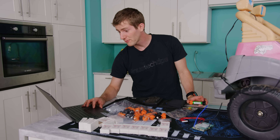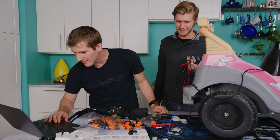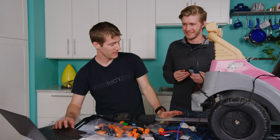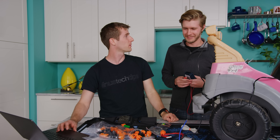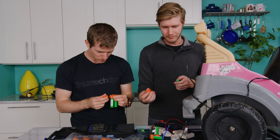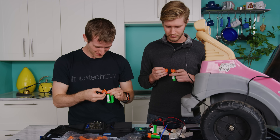It resists vibration loosening, it's safer. What we're doing today is building a modular lithium battery pack — a 7s3p configuration, meaning seven cells in series and three of those wired in parallel, giving us 29 volts and 30 amps at full charge. Construction is pretty simple, but if we wire up one cell incorrectly or even just drop a nut or touch a screwdriver across the wrong place, we risk causing a short circuit that could electrocute us or at worst cause the battery to explode.